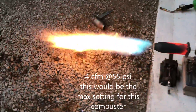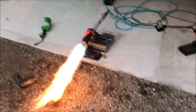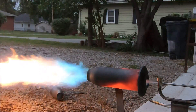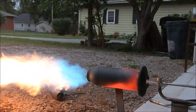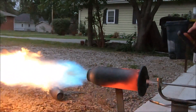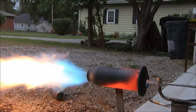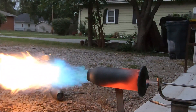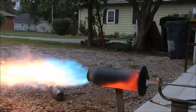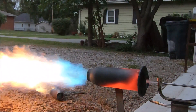I should do a decibel test tomorrow. It's not so bad, don't get me wrong — it's hard to say. It's pretty fancy too, but it's going to cost so much more to have that made. This is an exceedingly stable combustion chamber also. Look at the temperatures at the back end of the combustor there, and take note of the standoff I have on the fuel nozzle — that's creating a very significant Venturi effect. It's blowing back the pulse jetting as you can see, but because we have such a hot fireball going on at the back of the burner, that's a good sign this thing's extremely stable. It's not going to blow out very easily with that internal combustion going on in that zone.